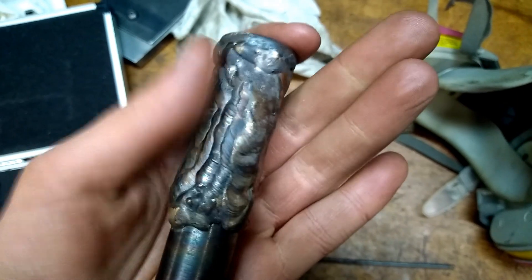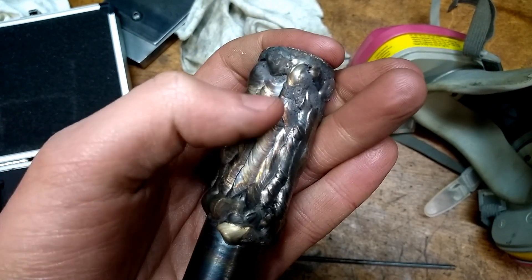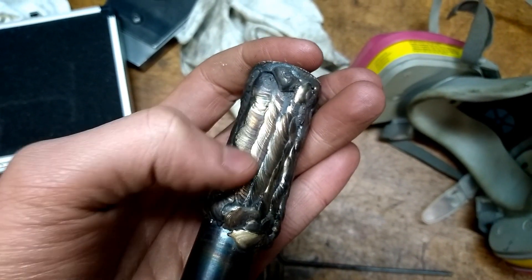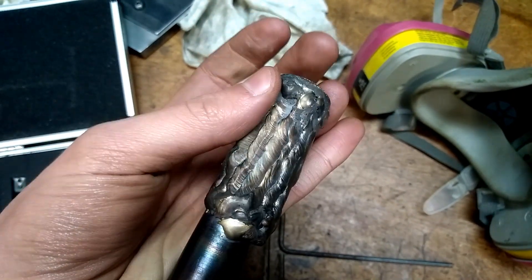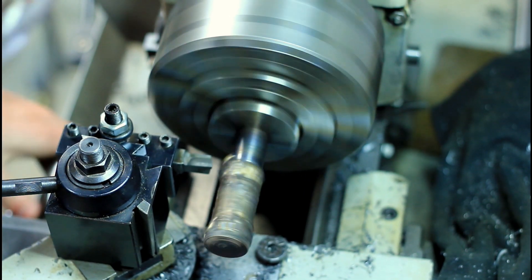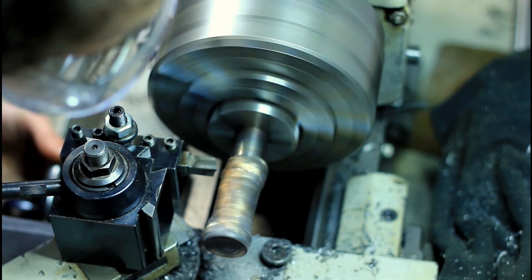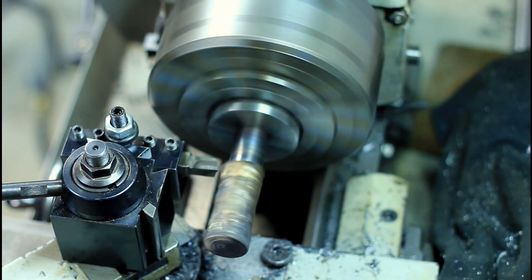We finished the brazing — it's not beautiful, but it looks best right about in here. I finally started to get kind of a rhythm going, so we're going to turn it down on the lathe. The silicon bronze turns really nicely; it produces a chip like steel but cuts more like aluminum.